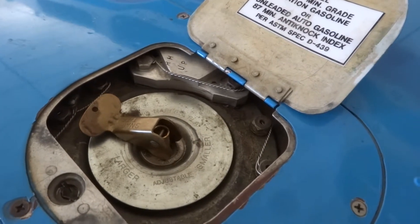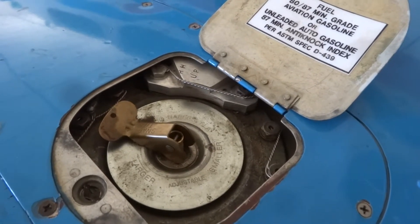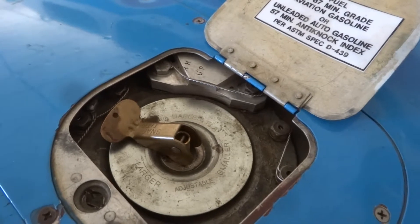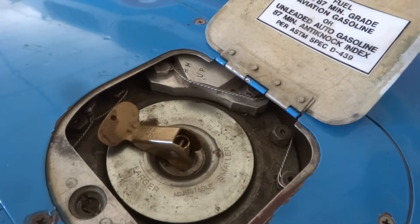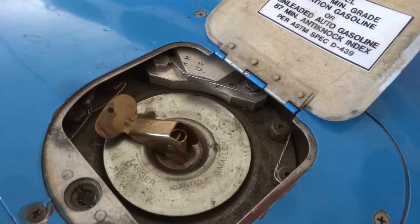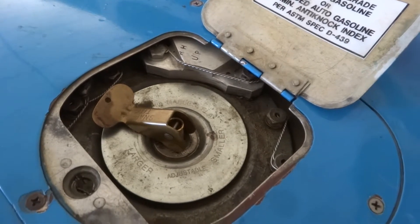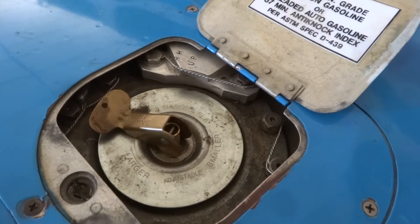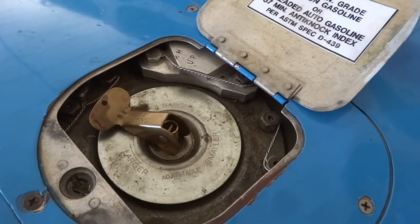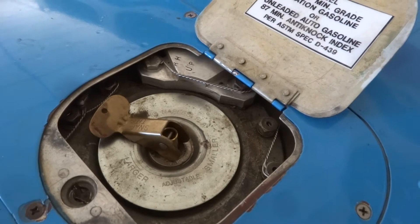It's kind of nice — you can fly the left tank down to a quarter tank, fill it up, and fly at the same time. You never have difficulty getting fuel to where you need to burn it, which is very nice. A lot of systems I've seen require very careful fuel management, and if you don't manage it well, even though you have fuel on board, you can't transfer it as fast as you're burning it.